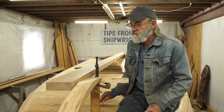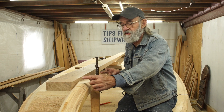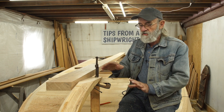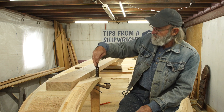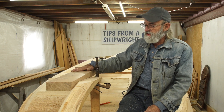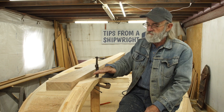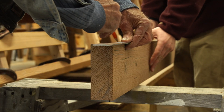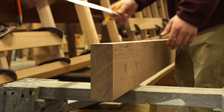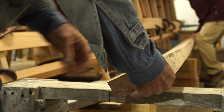I've cleaned the heel of the stem off on a long bevel like this - the idea is to get as much glue surface as I can between the heel end of the stem and the keel itself. I'm not trying to make any kind of hook scarf or do anything special like that. The whole boat's got plenty of fastenings in it, and this will be fastened there as well, but I'm going to glue it right on. The next thing is to take the keel down - I've drawn a line alongside it, so I have to scarf that end of the keel and then get it up on top and fit it a little bit. I'm continuing the tracement right around the forward end of the keelson, down the other side, all the way back to the original spot where I started.